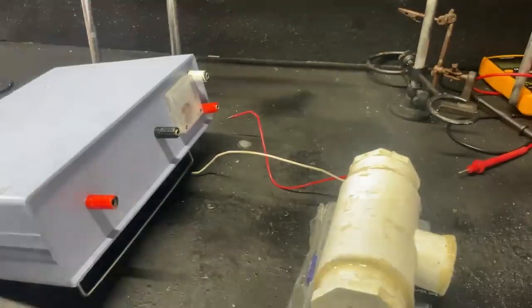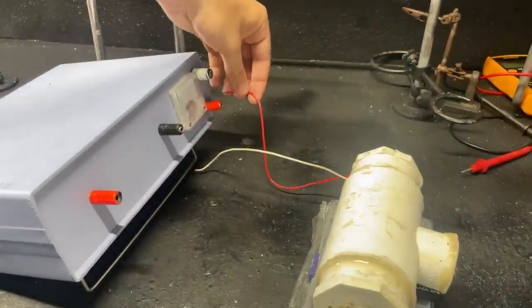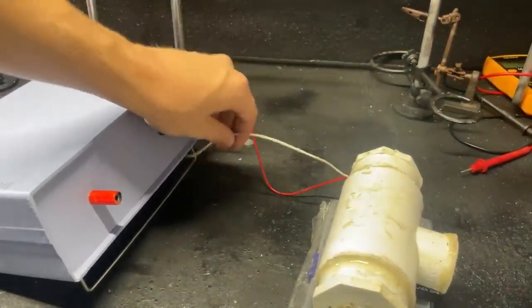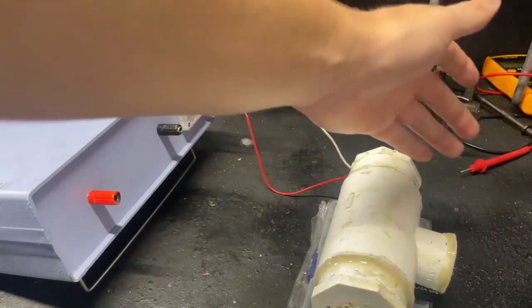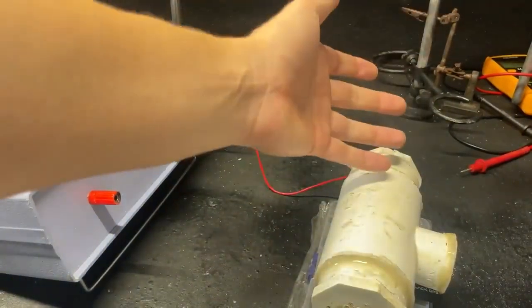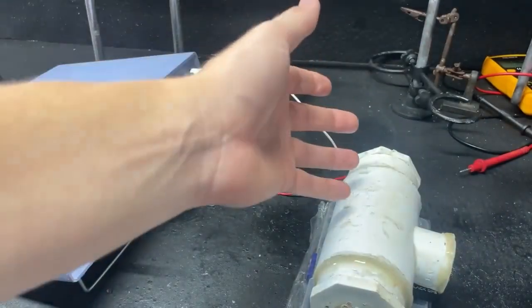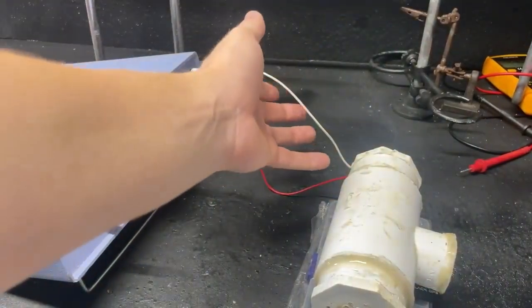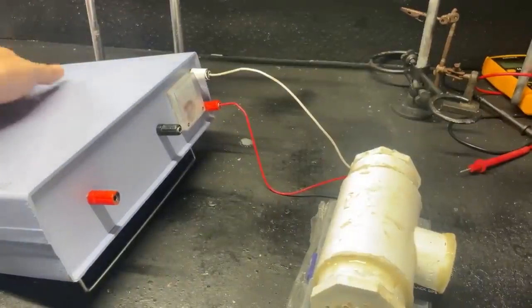Let's go ahead and hook up our x-ray tube to our power supply. This x-ray tube is different than a rectifier tube — in this case, it has a hot cathode, and that's what's different. We're going to hook up these filament wires. This is essentially a light bulb filament inside the x-ray tube, which heats up and allows more electrons to fly across the tube, which then allows more x-rays to be produced. So if you want to control your amount of x-rays, you control the temperature of the filament. That's why we have this power supply, which also has filament controls in the back.